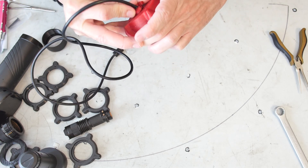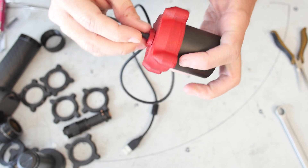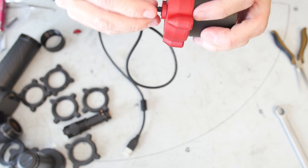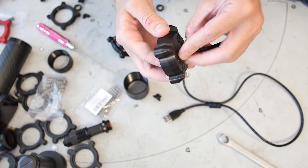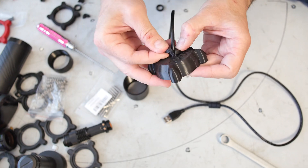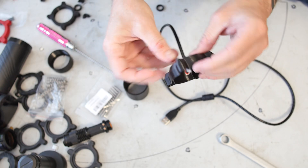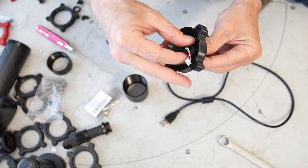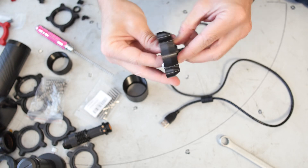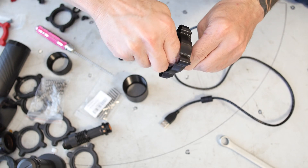The idea was for this to also be just a press fit — maybe it would work good enough — and yes, sort of it works, but clearly this would need another iteration or two. So I made this 3D printed cable gland — similar design, split so it goes around the cable, and then you have a little threaded nut to tighten it all together. Still a little fiddly to install. You insert the two sides of the cable gland holder through the top of the housing, then slide the nut over the cable on the inside of the housing cover and tighten it down.